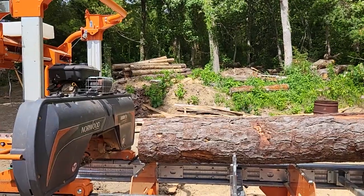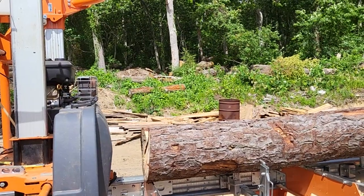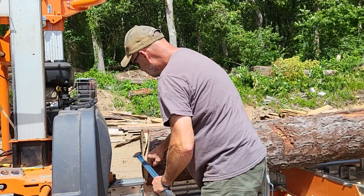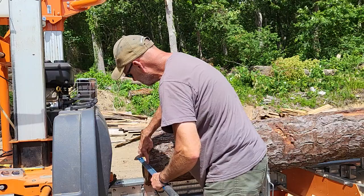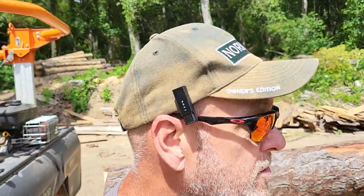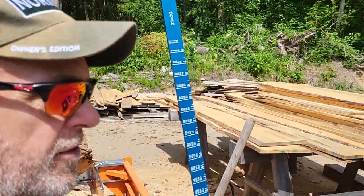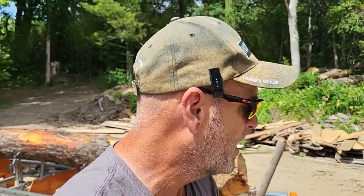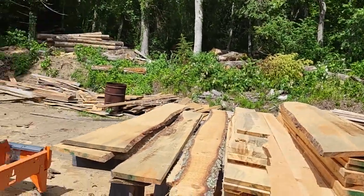So if you watch me do this, you basically have your 14 foot length, you hook it on the log, you see where you are lengthwise, and then you project your 14 feet across, and it's telling me 106 board feet. Let me show you how you do it with math. There's a little bit of a discrepancy, but not too much, because I think this Doyle scale takes into consideration the saw kerf, how much you're going to lose in kerf. And we're going to see which comes out better.